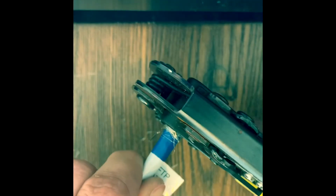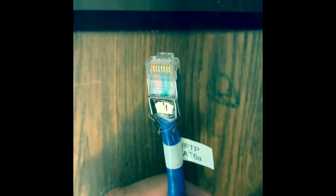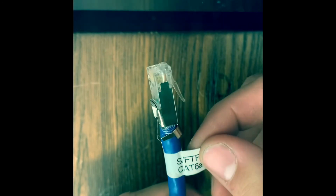All right. Pressure into the crimper. Pressure from the crimper onto the cable. 2 crimps. And with the strain relief, go ahead and straighten it out. As I said, needle nose is a little better, but I don't have that right next to me. All right. And there's your shielded foiled twisted pair.